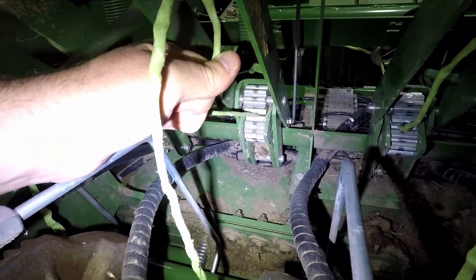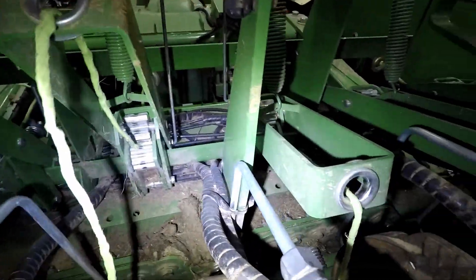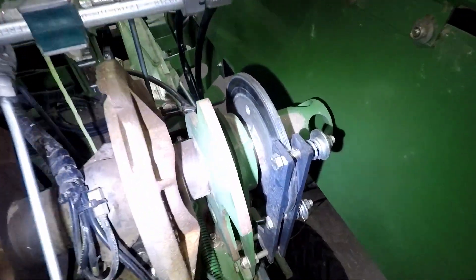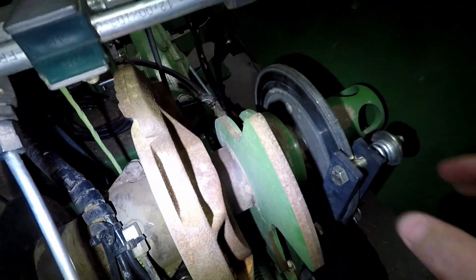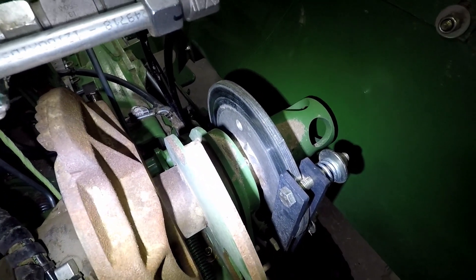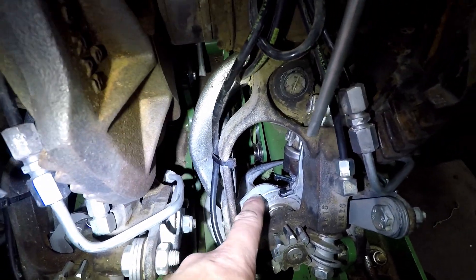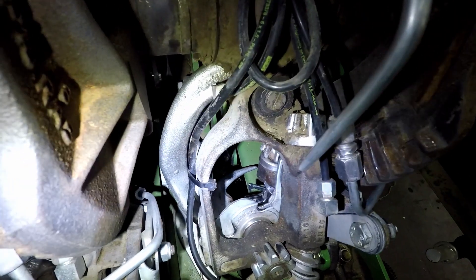Here, they've got tensioning rollers right there. It is actually quite hard to pull the twine through there, so we want nice, tight twine all the time. That gives us a better, tighter, more consistent bale with better ties all the time. And then over here, we have our brake pad. We don't want this to move freely, so we actually apply a brake all the time so that it's going to have some force to make a turn so we don't over-tie. Right here, our air comes up and we're blowing into our knotter system just to keep our knotters clean. So we can see some components here — our twine discs, our duck bill right down there. We'll go through all of that when we're going through lecture.